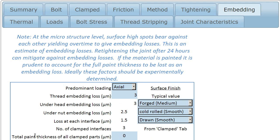The other area, which is very dangerous really, is if you ever have some paint thickness on your materials. Paint will just move out of the way whenever it's subjected to these high stresses. So basically, if you have a paint thickness of 10 microns when you started tightening up the joint, then you should really assume that is going to zero over time.